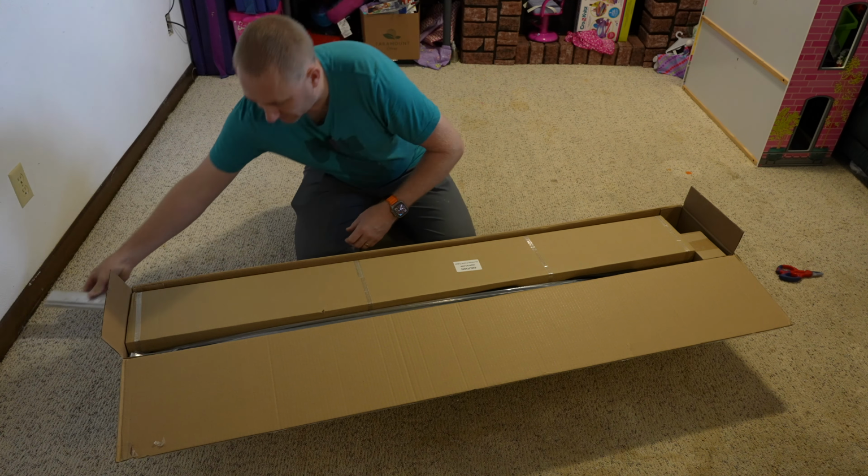Looks like I actually have an extra screw for this one, so that's good. It's always handy. Now I'm going to go back around all 4 corners with the square, square them up, tighten them down. So after doing all of that, I don't think I really needed this. As long as you've got the outside corner lined up and you squeeze it nice together so the gap from inside to out is about the same, every single one lined up perfectly. So definitely handy, but if you don't have one, don't feel too bad.